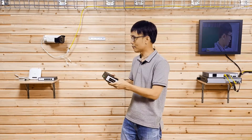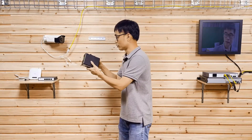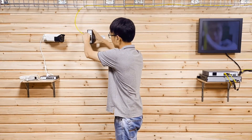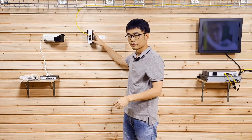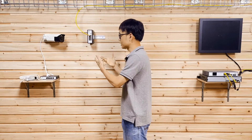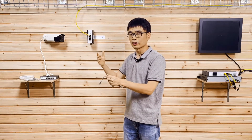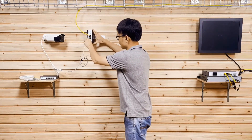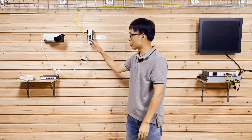What does that mean? Let me just make the connection to explain — it will be easier to understand. First, I'm going to hook up this switch to the din rail. Now I just need to get the cable from the camera and plug it into port number 8. Once I plug in, I can see all the indicators on. That means the switch is working. The PoE switch can be powered by another switch at the center and also provide data. Now I just need to use this short patch cord to link the camera back to the switch so we get video back. I can pick any of the ports. I can see the indicator — port number 2 is on. That means the switch is supplying power to the camera.